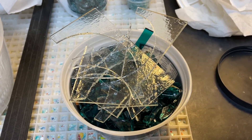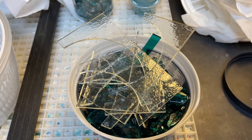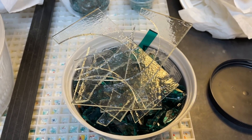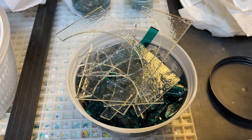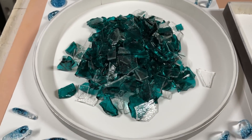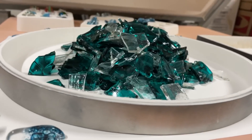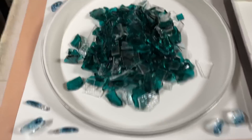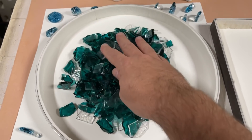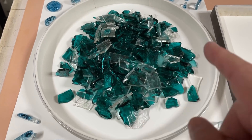A good tip: don't get rid of your off-cuts — always keep your scraps, particularly if you're going to be doing scrap melts, because that glass comes to good use. I chopped up the glass, put it all in a big bucket, and then dumped it in a pile right in the middle of the mold. That's not how I'm going to leave it though — I'm going to push it out toward the edges a bit.